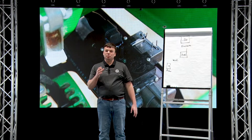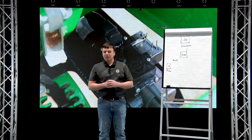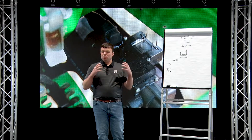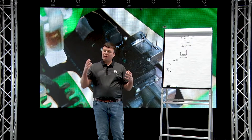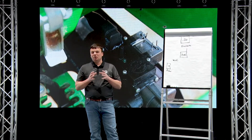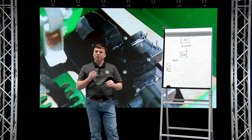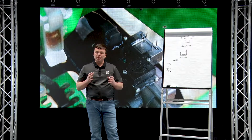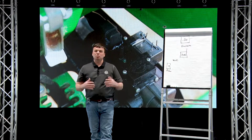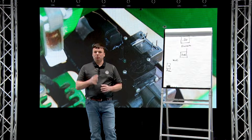As you watch the videos, you'll notice we use an AgXL pump system with Dash, and the question is why. The short answer is we need to be able to control pressure. You might think you could just add 360 Dash to an existing control system, but you can only have one control system at a time — you can't have two fighting each other. By using an AgXL pump tower that's Dash-ready, our software is set up to control it and ensure a good experience. As valves run at a higher rate or you go into a zone needing more rate, we can turn up pressure and stay in control throughout your planting.